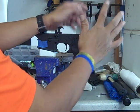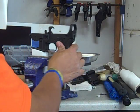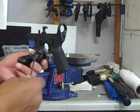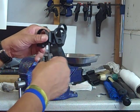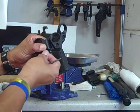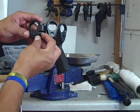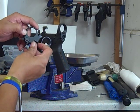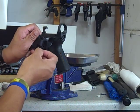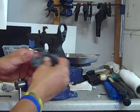You take apart your old stuff. Let me show you guys a little bit. Let me turn it so the camera can see pretty good. First, you have to take this little screw out. Take this out, put it in my magnet. This piece comes out. Then the push button, which holds the stock, has to come out — comes out in one piece. I have to turn that a little bit. Comes out with a spring, and this is the little piece that holds it in. Now you have it completely stripped.